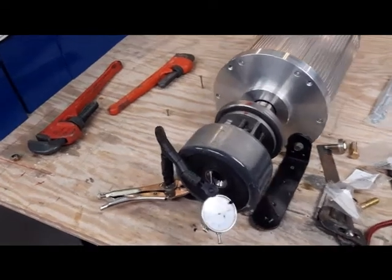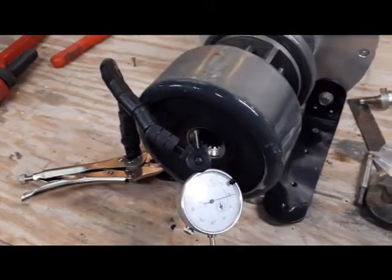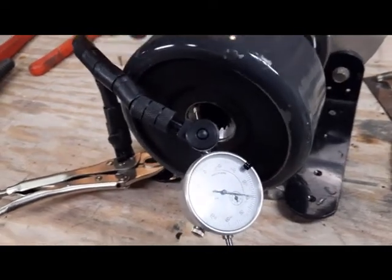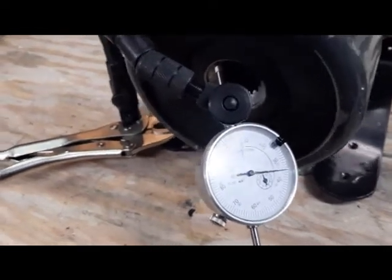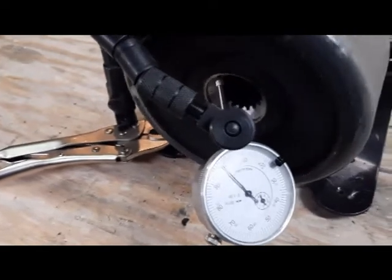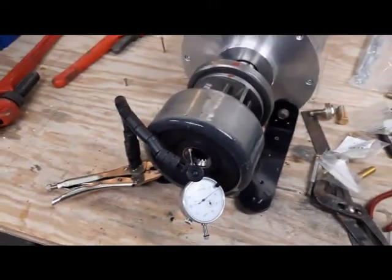The resurfacing of the stern drive coupling really didn't do me any good. I've got the dial indicator set on the inside of the spline, and we've still got that same 38 thousandths of runout. I don't really think it's going to be a problem, but I thought if I could fix it now that would be all for the best. We'll see.